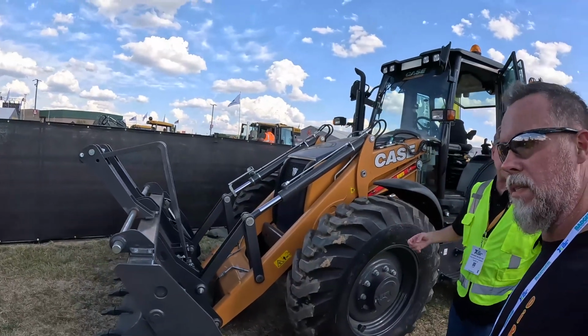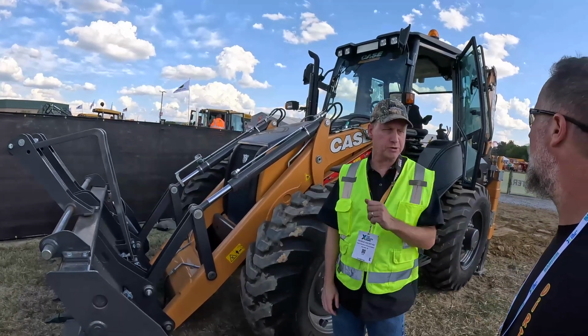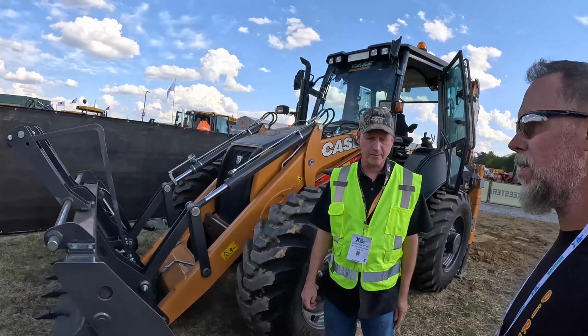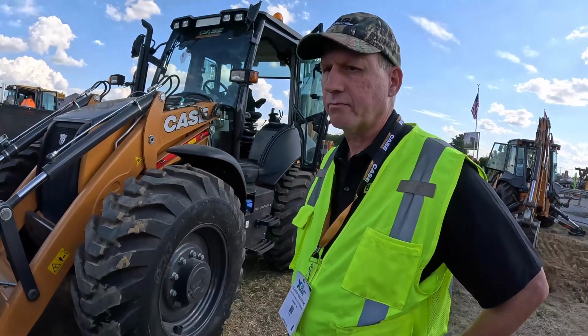It's got SCR system, so with the DEF fluid. No diesel particulate filter, so maintenance-free SCR. Maintenance-free, just stick your DEF in and go. Right. Is there anything we need to know as we do a walk around on the other side, George?